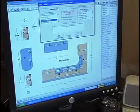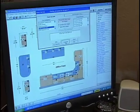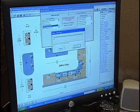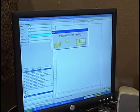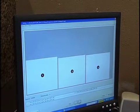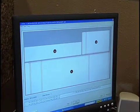This is a Prairie kitchen, so he's going to click on SWI Prairie CNC, and then he is going to nest the product. And if you look at the screen, it will now show you that we are putting the appropriate pieces on the appropriate sheets and utilizing these sheets to the best of their yield. He is now hitting View Sheets. It will put the appropriate pieces on the appropriate sheets. And without further ado, we will head to the production facility and watch this be cut out. Good deal, we'll be right back.